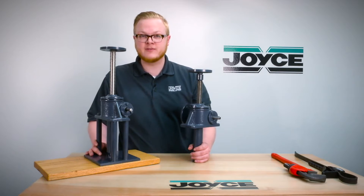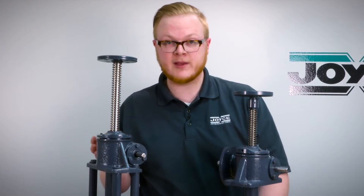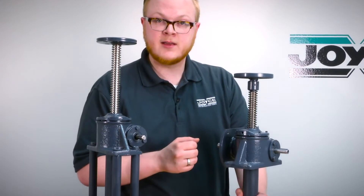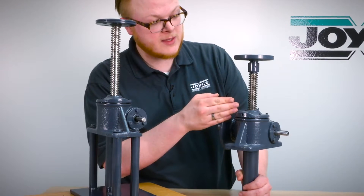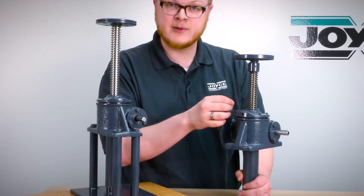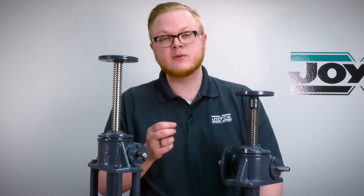This is a translating jack, and the screw is allowed to rotate — it is the easiest screw to remove and replace. This is a keyed, or non-rotation, jack. The differences can be seen by looking down the screw itself and observing the keyway that is cut out. There's also a key in the sleeve cap that prevents rotation of the screw.